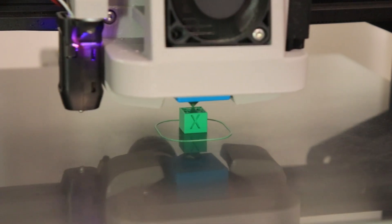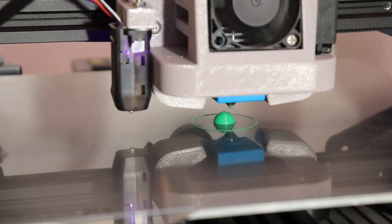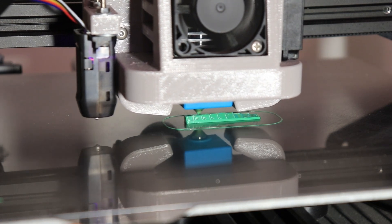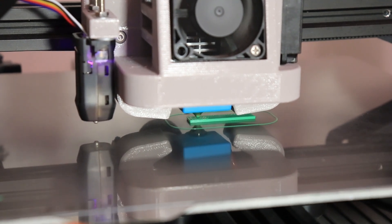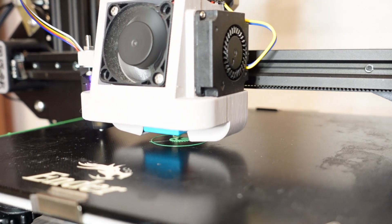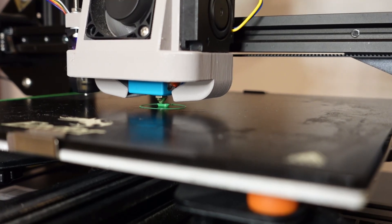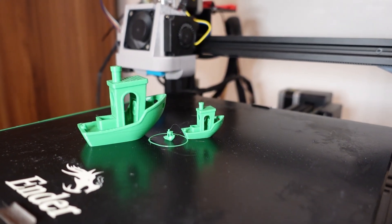The next one is the calibration cube, size 10mm, and the next one was the 10mm hemisphere, and it came out really nice, this half-ball shape. The next one was printing surfaces from 5 to 45 degree angle with a step of 5 degrees, and the next one is a badge with some very small lateral letters. Then I printed a gear of Modulus 0.5, and this is a half-size Benchy, and this is a 15% size Benchy — the smallest object I printed. These three Benchies are here just for size comparison.